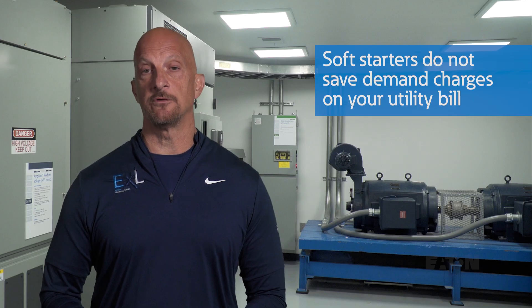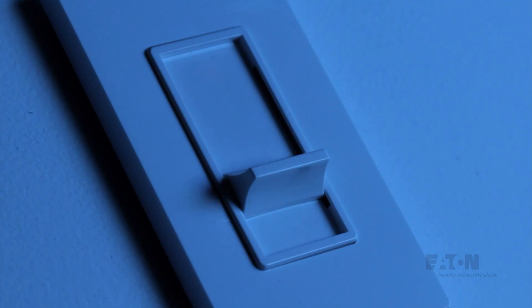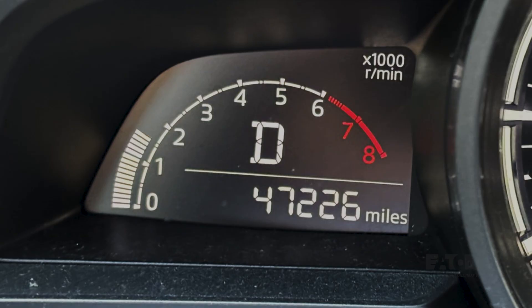This is a common misconception to be aware of. There are several key settings on a soft starter and it's important to understand how those settings affect the starting time and the inrush current. A variable frequency drive offers a more refined soft starting capability as well as the opportunity to control the speed of the motor after starting. Using the light dimmer analogy, you could change the light from off to any output level and leave it there without going to full output power. With the vehicle analogy, you could slowly adjust your speed from a stop to any speed and stay there — and beyond that, you could readjust your speed or even slow down to a stop. Controlling the starting, stopping, and running of a motor are completely adjustable with a variable frequency drive.